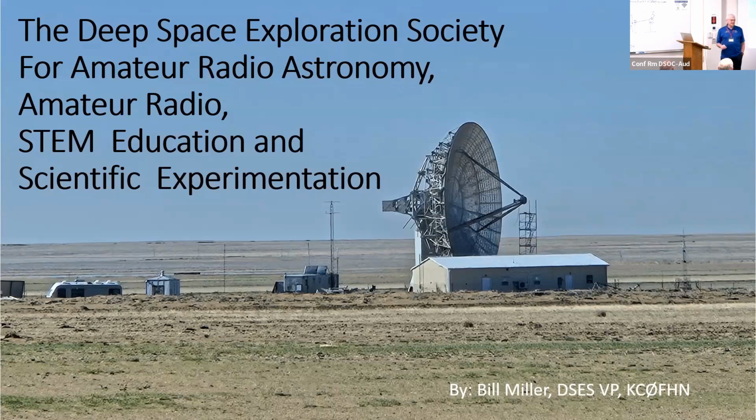I was just going to mention on Jack's presentation, for small telescopes, there is a solid state inclinometer that you can also use. And we've actually done that with our interferometer small dish radio telescopes. The beauty of that is you can just glue it to a position on the scope and you don't need any mechanics. And so for at least elevation, you could do that.